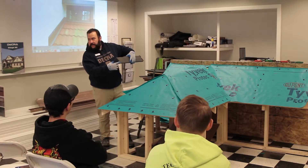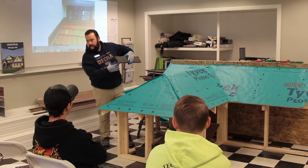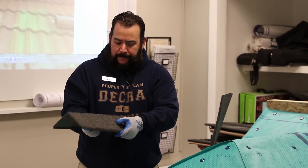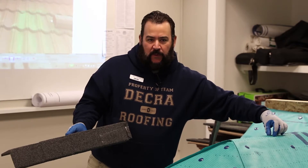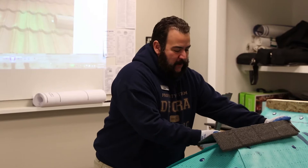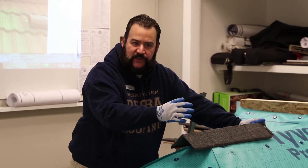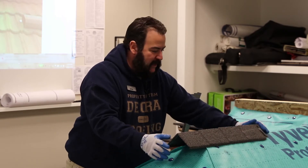We've got our ridge beam in there, we've got our decking cut out. Where am I going to screw this? So one way if you do run into that scenario is either fabricating and making your own cap, or you can run a 2x2 down the center over your ridge beam — or if it's trusses, toenail it to the tips of your trusses. That way our panels may be floating underneath, but we've got the beef of the 2x acting like a stringer, so you know you're always going to catch something solid down the center and actually be able to attach the cap.